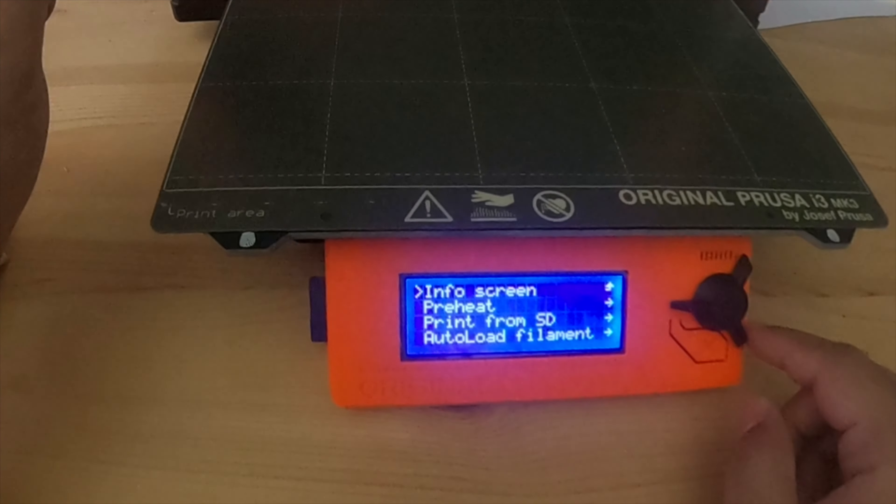What you can see here is the space where the existing PETG is being spit out by the extruder, and the newer filament is being pulled in. We wait for the color to be correct. I don't see it being exactly gray yet, so I'll say no and let it spit a bit more out. Now it's completely gray, which means the extruder and nozzle are clean — only the new PETG material is coming out. Always use a cloth to wipe it, and we're good. Press yes.